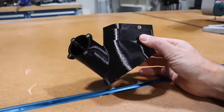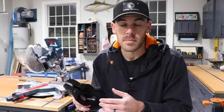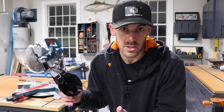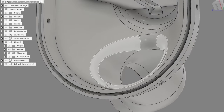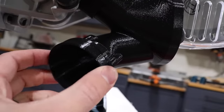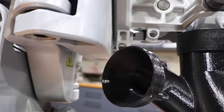That's where version three came in. I added a gentle curve to the back end of the suction port to try and clear the arm. I also changed the geometry of the front opening to better accommodate the blade guard and create more of a natural flow into the dust shoot. In fluid dynamics, whether we're talking about air, water, or air with sawdust in it, everything within a flow system will induce some amount of friction, so to promote more flow you want to reduce that friction. After getting this mounted and testing adapters on the back flange area, I still didn't have the clearance I needed.